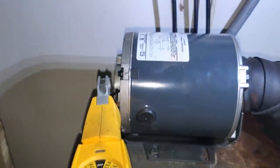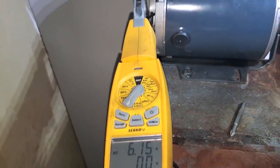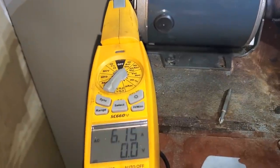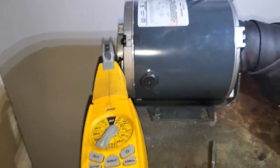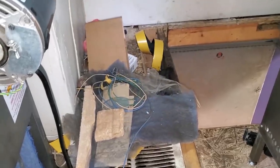Always want to test the current draw of the motor, especially under a heavy load. The glycol isn't at full cold yet, so it's probably not under maximum load, but we're right at run load amps, so we're looking good. Last but not least, as usual, I'm going to clean up everybody's trash. There are blocks and ceiling tiles up here that don't need to be here — too much crap. We're going to clean all this up so we can actually work up here.